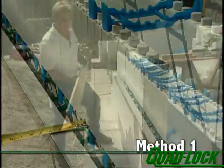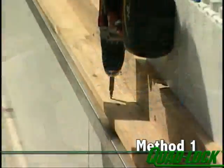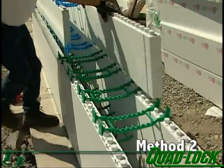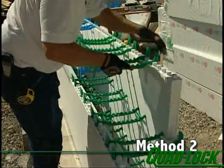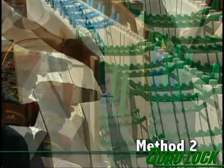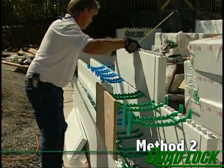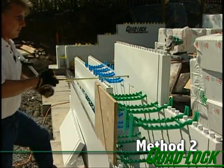Brace the transition level with 1x4s as shown. Use 12-inch ties on the bottom row to form the side of the edge for a 3.5-inch brick ledge. An alternate method would be to screw a 14.5-inch strip of forming plywood to the outside of the ties. Simply pour to the top of the plywood level, then continue the wall from that level with a second pour.